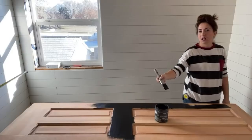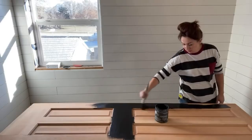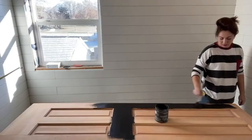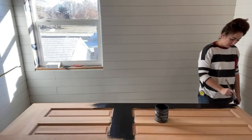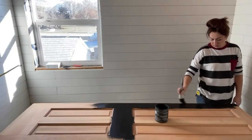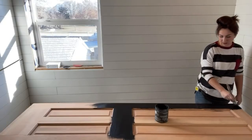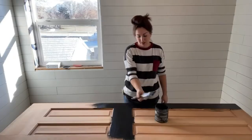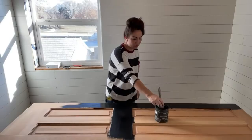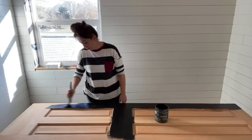If my math is right, 23 and three-quarters equals 47 and a half, then I leave a half-inch gap so it can swing well and compensate for each side of the hinge. Maybe I'll go a quarter inch so there's not a huge gap between the doors. Worst case, we bust out the belt sander — that's magical for shaping doors to fit in door jambs. I'm using my two-inch angled zebra brush, which has been my go-to for trim here at the farmhouse.